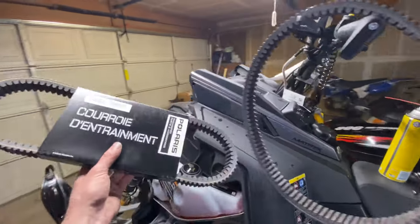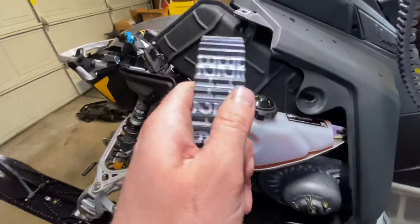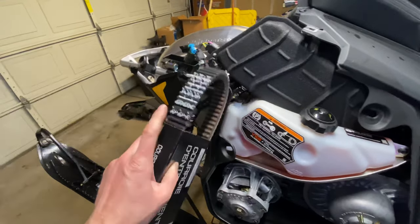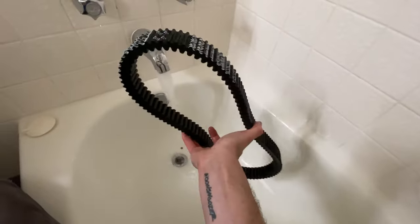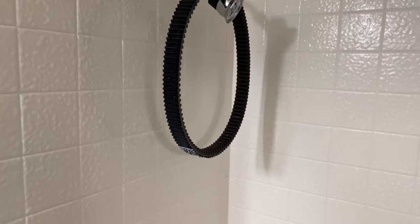I got my belt off the machine and my new spare belt. I'm going to take these inside and give them a wash. The reason we do that is because when you get these belts they're kind of slippery — there's a coating put on them during the manufacturing process that helps them release from their mold easier, and that slick stuff is what's left over. We wash it to get that off so when we put it on the machine it's not slipping at all. Bring it in, get some warm water going, put some dish soap on it, lather it up.